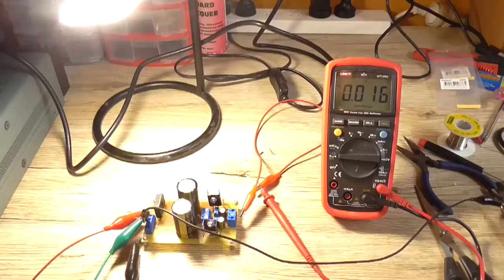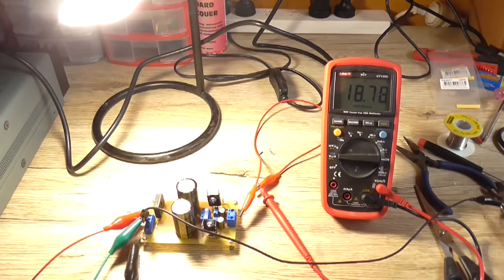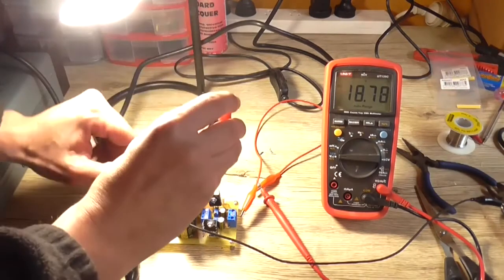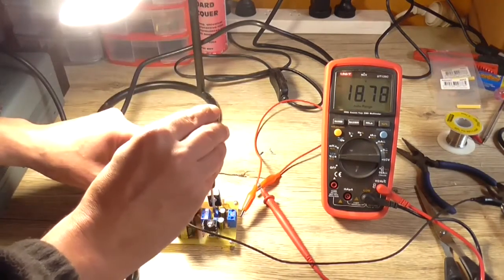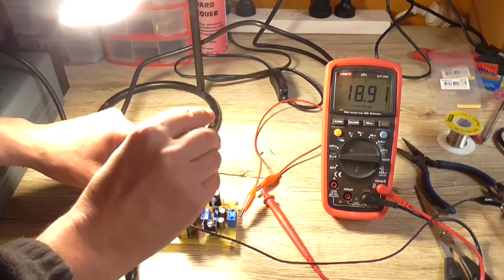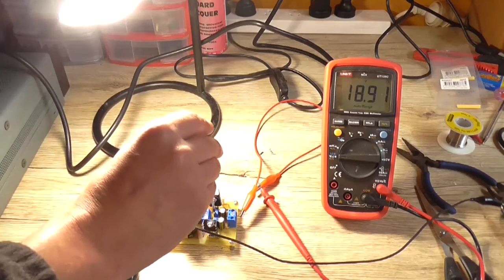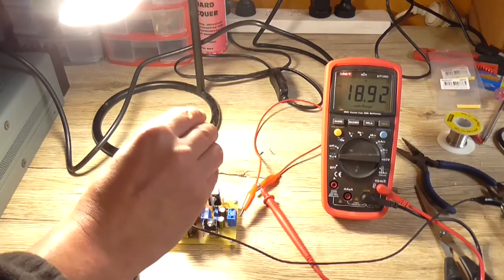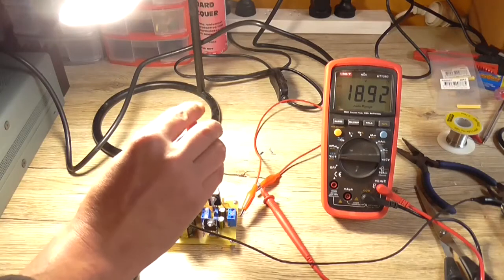So I've put the supply voltage back down to 20 volt, just to be on the safe side. And I've got more like 18 volt coming out of it, which is about where it's supposed to be. So, if I increase this, I want to see how far it can go. Right, we've peaked out at 18.9. I'll just increase the supply voltage. It's not changing, so I can back this now off to where it's supposed to be,